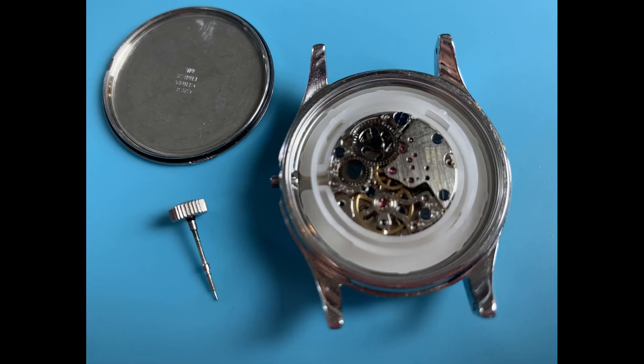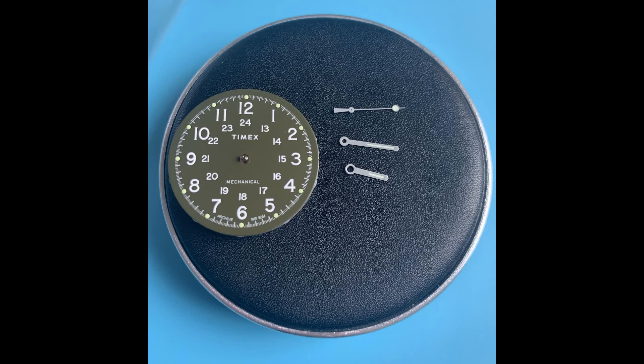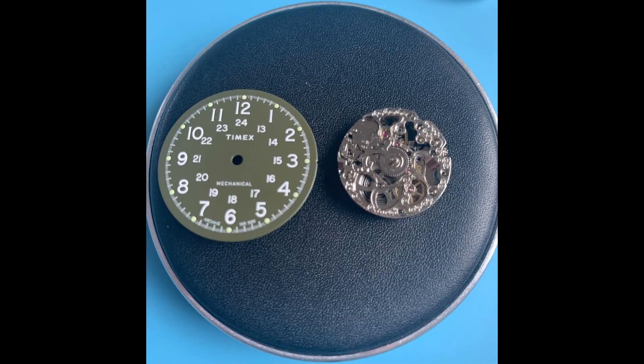Next we have the crown — it's very easy to remove by depressing a small button close to the stem. Here we have the dial next to the case and the crystal. Here is the dial with the hands removed. Next I removed the spacer. Most movements use a spacer to hold the movement inside the case of the watch. This spacer was very large and very tall to compensate for the small size of the movement, however it was very well designed. By loosening two dial screws you can release the dial. You can see on the motion work side of the movement the watch is also skeletonized and decorated.